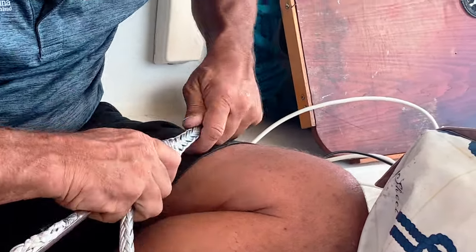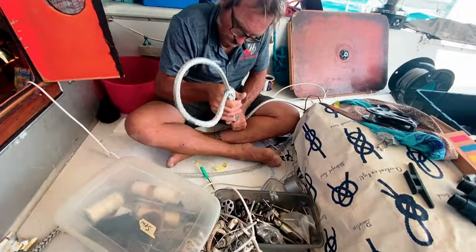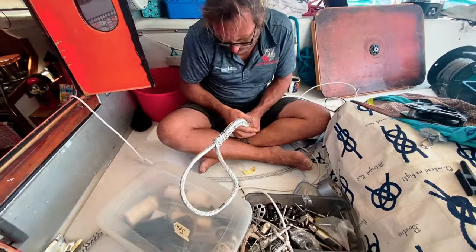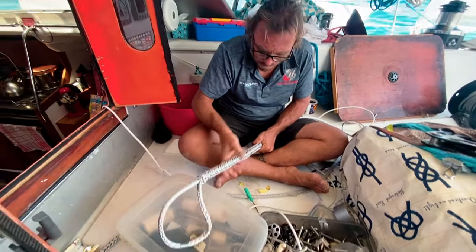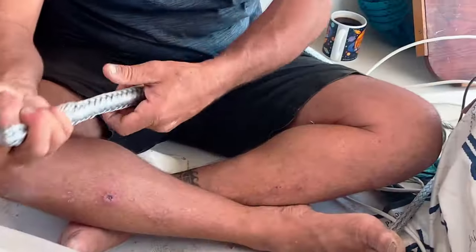Backstays provide additional support for the mast, counteracting the forward force exerted by the headsails. Since this new forestay attaches to the mast at a different position than the existing forestays, we needed additional running backstays to support the mast at this new position.